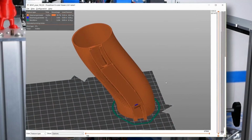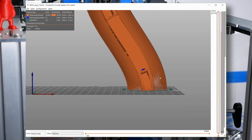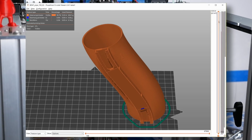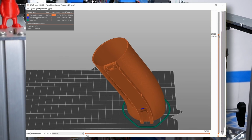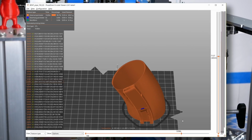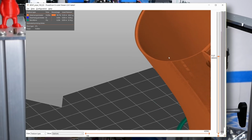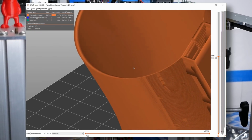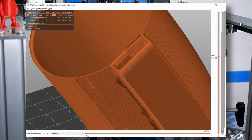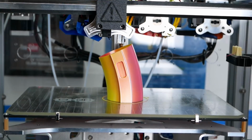So let's look at our results. G-code viewers seem to have a bit of a problem displaying the results, so please be aware that some lines look a bit strange. And just that simple, we have created non-planar G-code, where the printer continuously uses all of its axes in a significant way, instead of just stacking individual layers on top of each other. That makes the printing process look really mesmerizing, and the final parts look beautiful, especially with a dual extrusion filament.